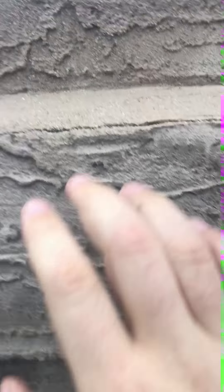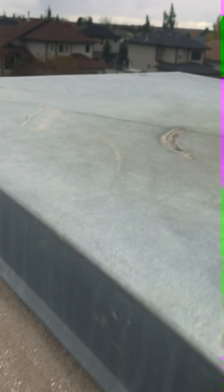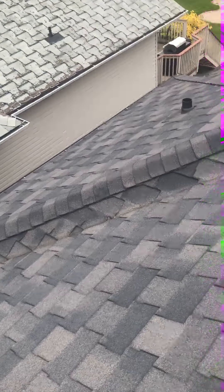There's a saddle built back here — we'll be reusing that. Step flashing is put in by the stucco, so we're going to reuse that because you don't want to cut the stucco if we don't have to. It looks like it's in pretty good shape — no major issues. You're getting some cracking up here and up here, but nothing too major. No major rust spots, so you're not pooling any water, and all this caulking I checked is in good condition. So I don't see any reason to cut the stucco.